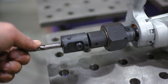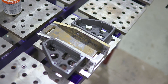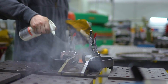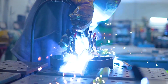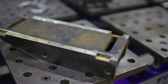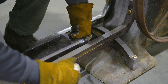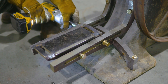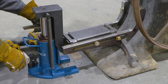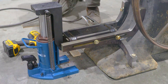Before I can do the final assembly, I need to get this motor sled put together. By tapping some holes with my power tapper and then using the minion squares to align everything up perfectly, I made myself a place to put a nice fillet weld. That way I didn't have to do any v-grooving when I went to weld these parts together. Now that the sled is welded up square and perfect with the minion squares, I'm able to use it as a fixture to permanently combine the whole system together.